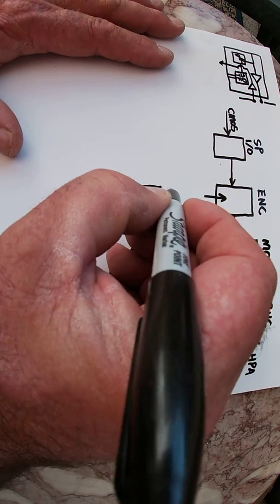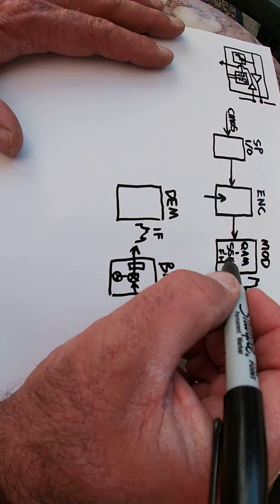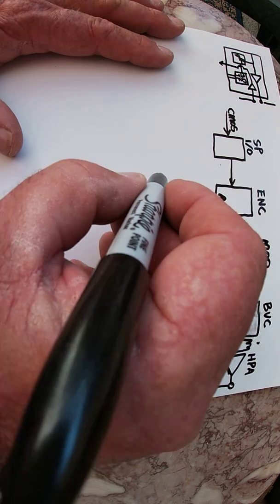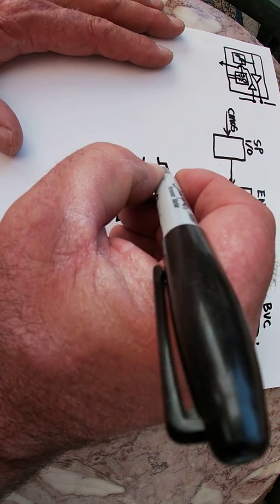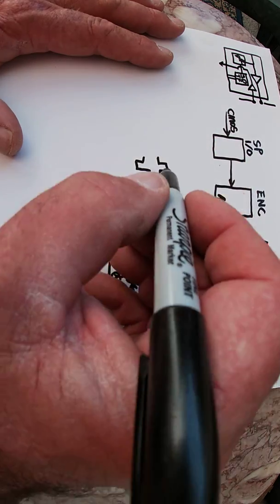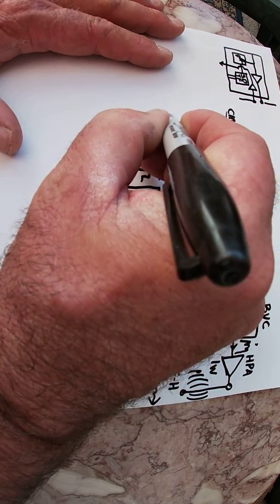Taking in the demod, it's using the same type of modulation scheme, QAM. It unspreads the signal if it's spread spectrum, it unhops it, gets a stable carrier, and then demodulates it. And now coming out of there, you've got data. Could be NRZ, could be bipolar, it could be just single phase, single direction NRZ. But either way, it goes into that encoder again.